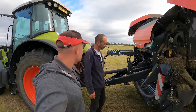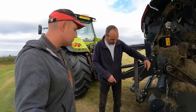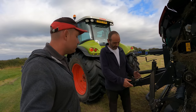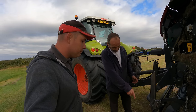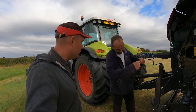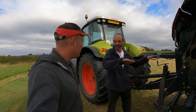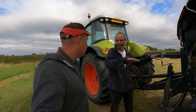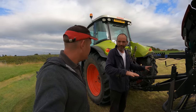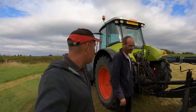There's a lot of things with these adjustable wheels. The other one you had to have spanners and nuts and stuff - to adjust it you had to guess the depth because it was on a slide. You never got them exactly unless you did it on the concrete yard, but that's no good because you're not in the field. With these you just put it in the same hole each side and you know they're the same. I'm pretty impressed with that.